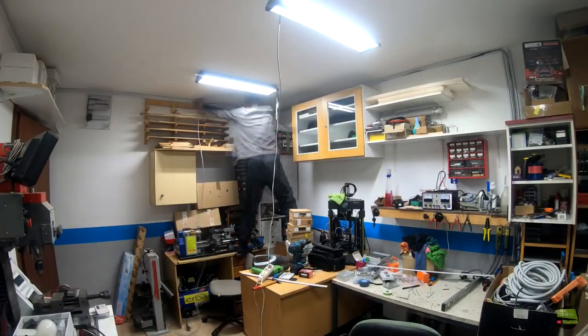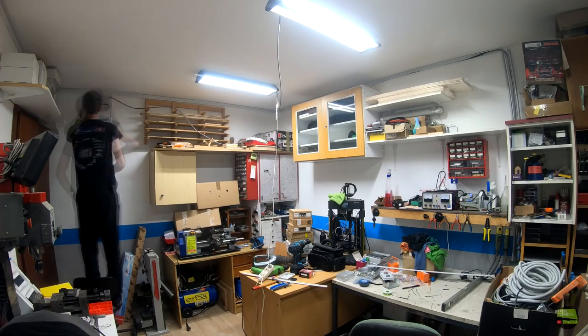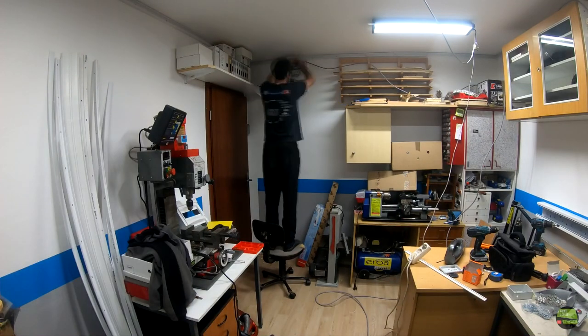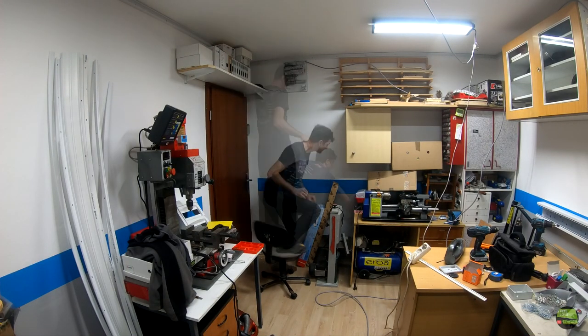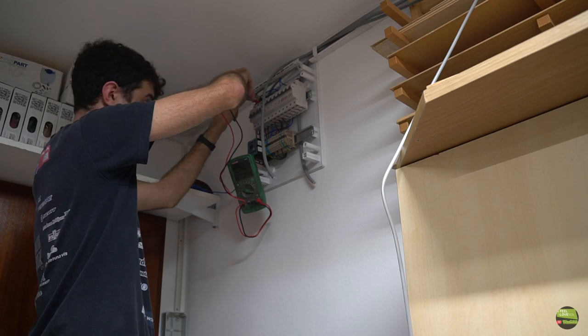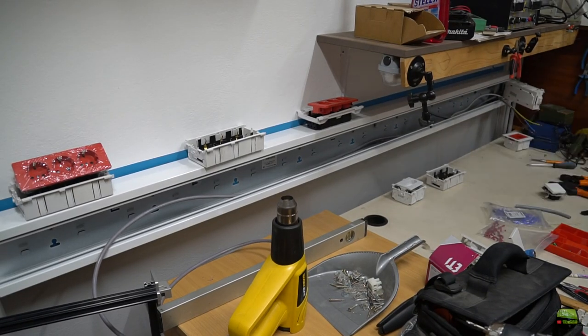Okay, here I got mounted canals on the walls, the main cabinet and a small box for the buttons next to the door. Then continue with installing the cables and mounting the first modular canal. One part is wired. I got some tough work here because as usual I took 2 small canals, but okay. Here I got now 3 cables from the main cabinet, for online and offline sockets, 3 phase sockets and a tube for compressed air. The power cable is already live, so I just check if all the phases are okay, then start with assembling the first modular canal.